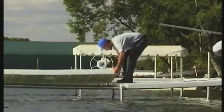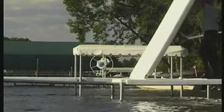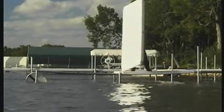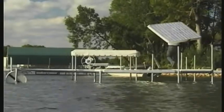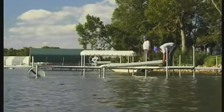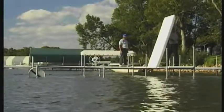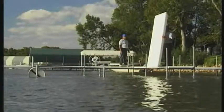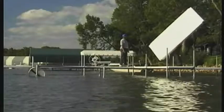When removing the first deck of the 16-foot framework, pull it back completely onto the next deck. This procedure allows more control when lifting it onto your shoulder. Remove the second deck by pulling it back and standing it straight up. Then walk one corner up onto the next deck and pivot the deck back at a 45-degree angle to lift it onto your shoulder.